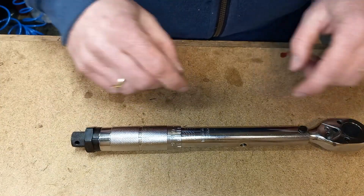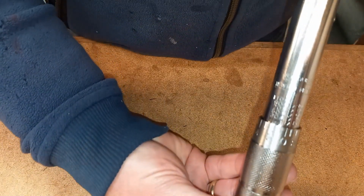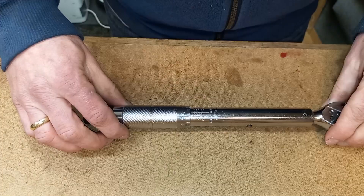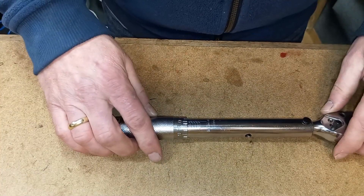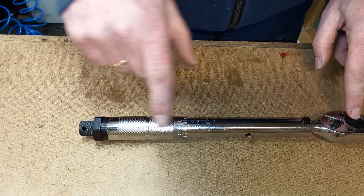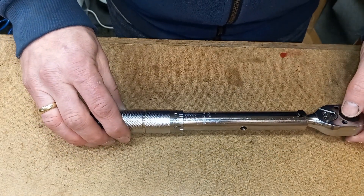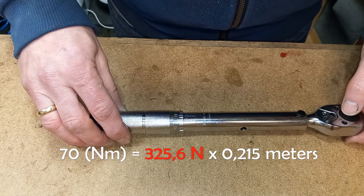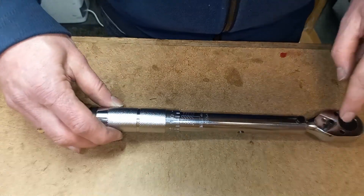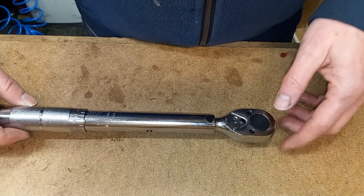Now on to the mathematics. Mid-range in this case is 70 Nm — there's a foot-pound scale on the back and Nm on the front. 70 Nm is the result of a yet unknown force applied to the arm of 21.5 cm. I'll blink the formula on screen. I have to apply a force of 325.6 N on the grip to reach 70 Nm of torque. That's about 32.5 kg.